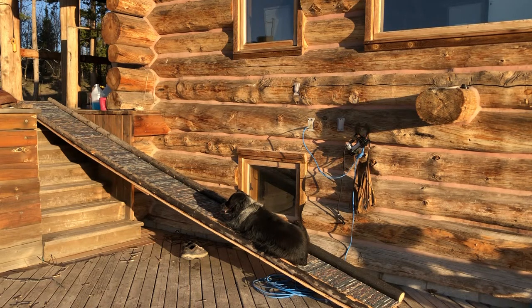And I took the scrap piece that was left over and cut a 20 inch section out of that, and I just used that to overlap at the joint and screwed it from the bottom upward, just overlapping to support that joint area. I'll flip this to the side and show you in just a moment. But that is not enough to support the weight at that joint section to keep it from collapsing or buckling.